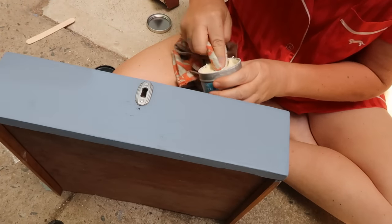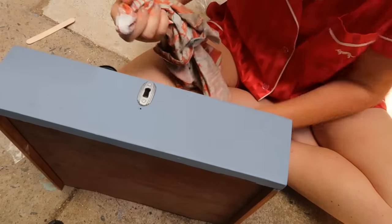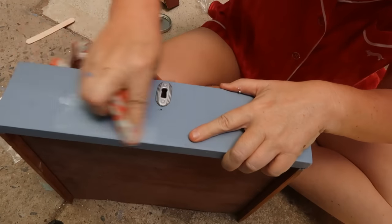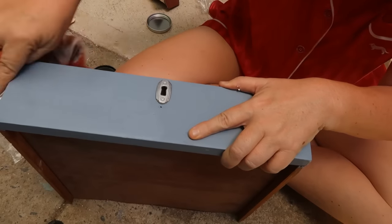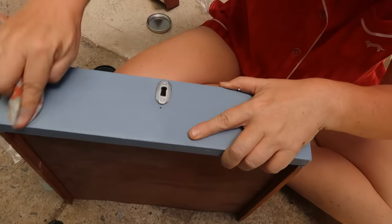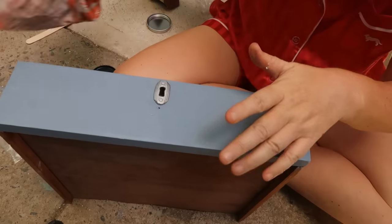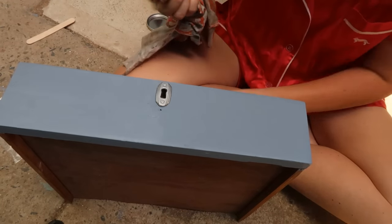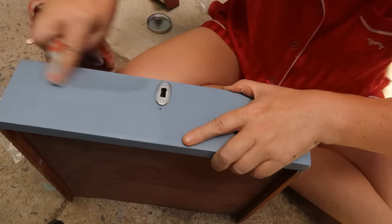I don't have clear wax, so I'm going to go with white wax, which is quite clear anyway. And I'm going to rub it right in, because I'm not really bothered about the white underneath it as well. I just want a little bit of dimension, really. So I'm going to go on with the white first. And that'll make it easier for me to move the black around, because obviously what you don't want is for this to take over. So now I'm just going to rub that in,